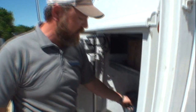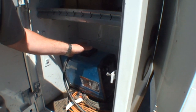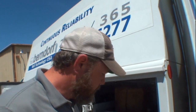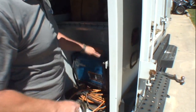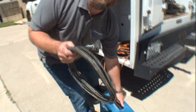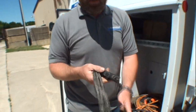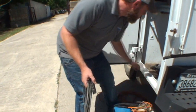So what kind of welding is this — MIG, arc? Step right over here. This is the Miller MaxStar 200. This little box provides all the heat you need for TIG welding. We also use this little thing — it's called a rheostat. A rheostat lets you turn your heat up and down. Pipeline welders have a ditch box that's also a rheostat — it controls your amps higher or lower.